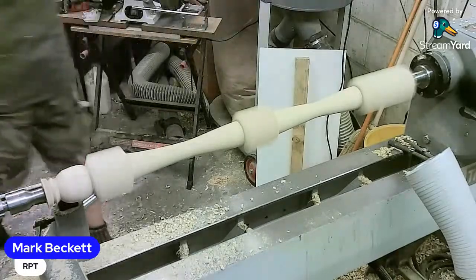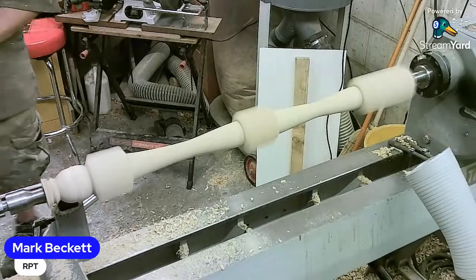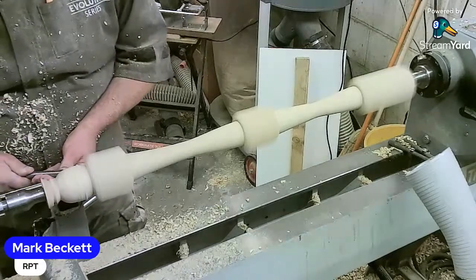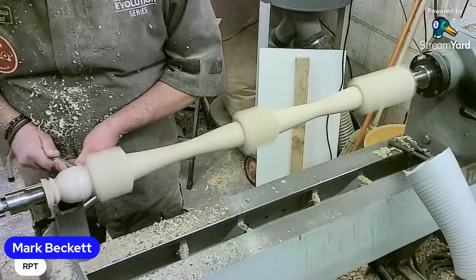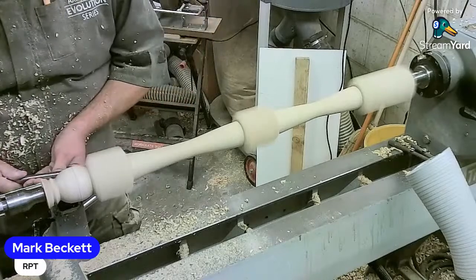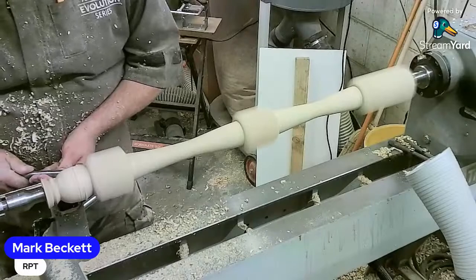As I remember the VB36 is pretty high - well, the centre height on my VB36 is elbow height, same as my other lathe. My centre height right now is at 47 inches, which is three and a half inches higher than manufactured. I did that because at the time I was doing a lot of hollow forms and my back was killing me from hunching over.